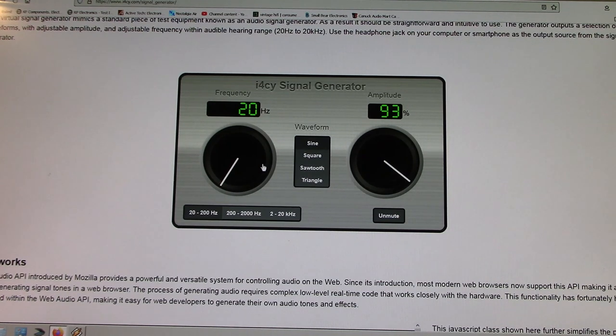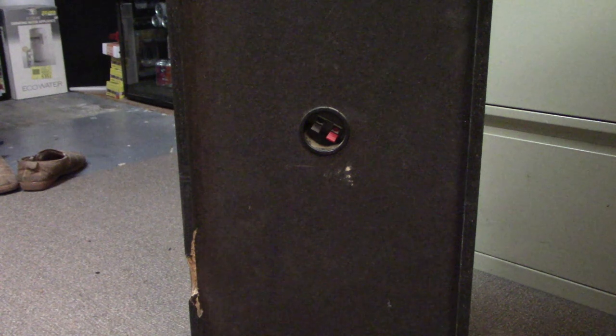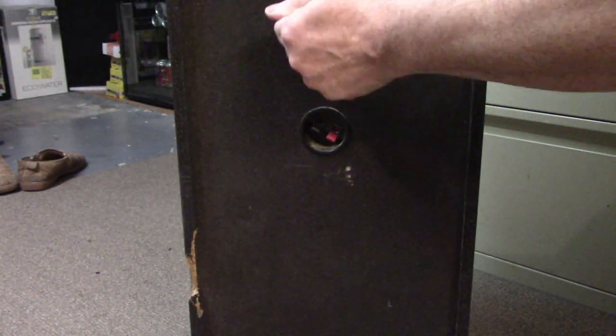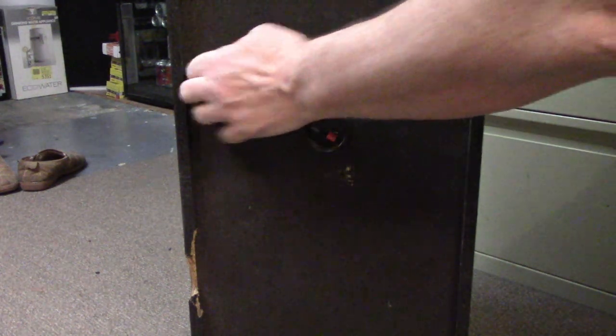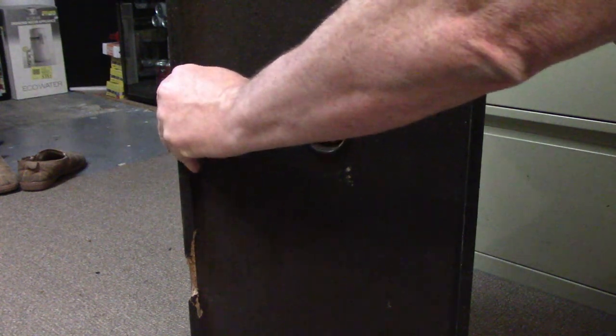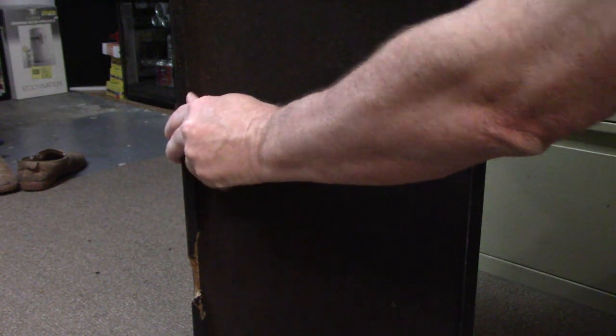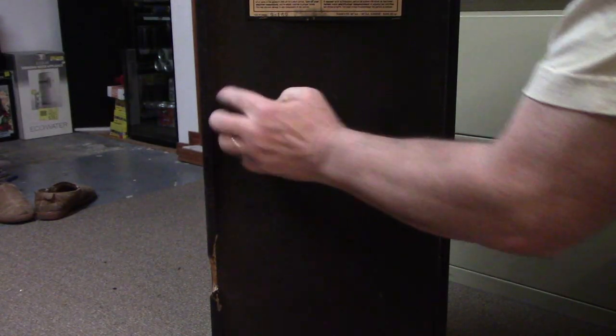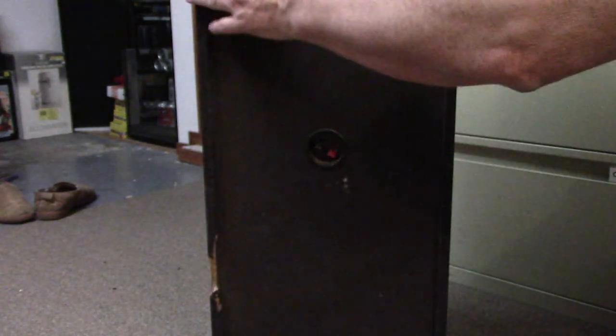The low frequency ones are the most offensive — especially with bass notes, you're going to hear all kinds of weird stuff coming out of your speakers. Now let's address those. Looking at the left speaker — the one that's most offensive — I noticed during the pure tone tests that the buzzing seemed to be coming from the back panel. If I knock on it, you can hear it has a vibration to it. Maybe the glue has let go.